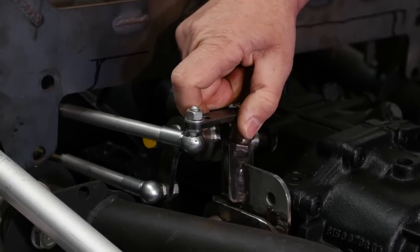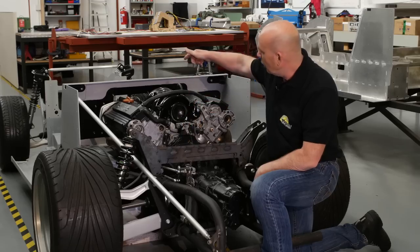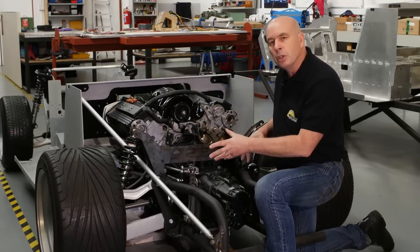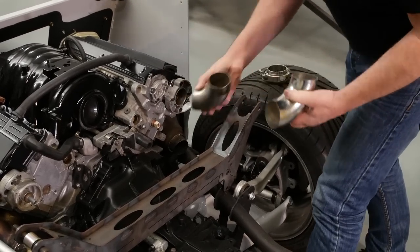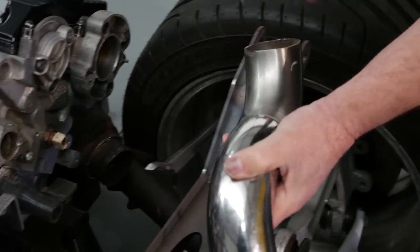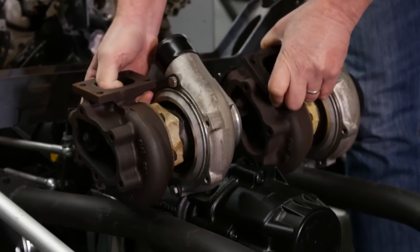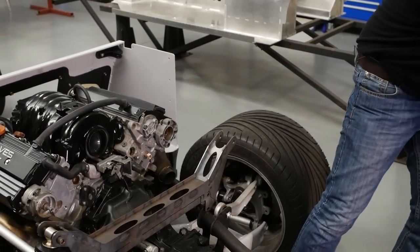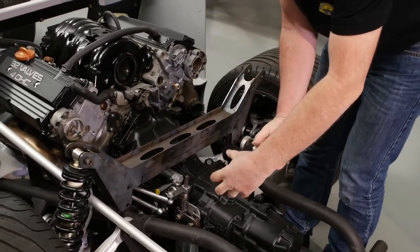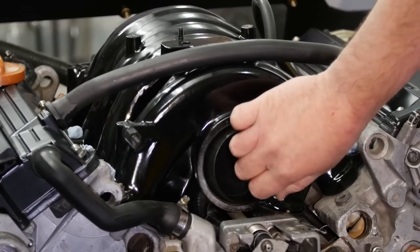The gear shift on the six-speed box is controlled by two push-pull cables. The movement is a fore-and-aft movement and a left-and-right movement, which is controlled by the gear shift lever. The reason we've designed this now already is because we need to work out the space in this area for the two turbochargers. The exhaust gases leave the engine via the exhaust manifold and we will be doing some kind of routing like that, getting the exhaust gases away from the engine towards the turbochargers. These would be held in place with a clamp like this. The two turbochargers are probably going to be positioned somewhere over here, but the complication is that this exhaust gas needs to come all the way to the turbocharger. Once that exhaust gas gets to the turbochargers and they spool up, the clean fresh air needs to come back towards the intake manifold which is sitting over here.